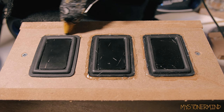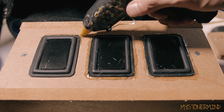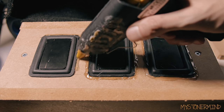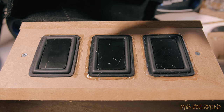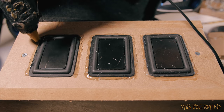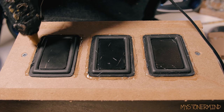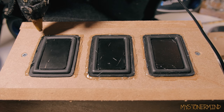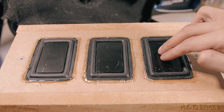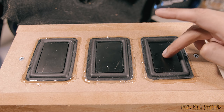This is the third bass radiator being put into place. It's kind of hard to work with hot glue sometimes. One of the benefits of working with hot glue in this scenario is that it raises the bass radiator off of the wood a little bit. So if, for example, you haven't cut out the holes properly, the glue is going to raise the bass radiator off of the wood a little bit — you're going to have that little extra clearance. Here you can see me pushing them in a bit just to give them a test, and they are working perfectly.